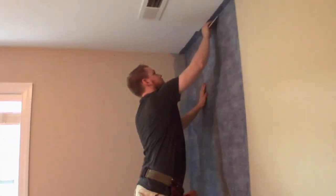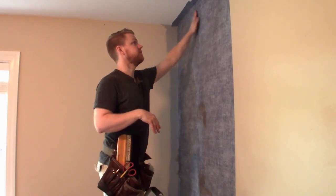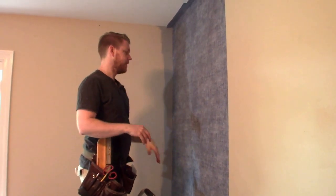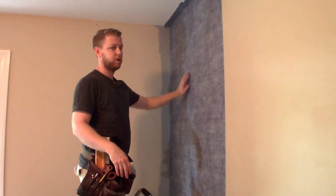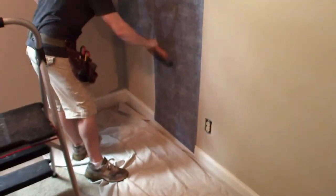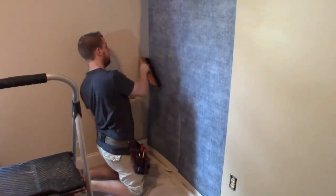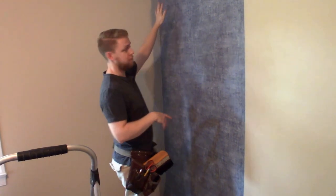We look pretty good, so we'll go ahead and work this out. When hanging wallpaper, remember that when you get it up on the wall while it's still wet there are going to be bubbles and the seams might pucker a little bit. Give it a little time, go do something else, come back and check — a lot of those bubbles will work out and your seams will lay down flat. I dropped the second piece down before working the first piece down; if the corner is truly straight, drop the second piece and then work the first piece back to the corner.